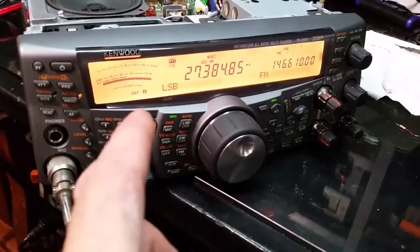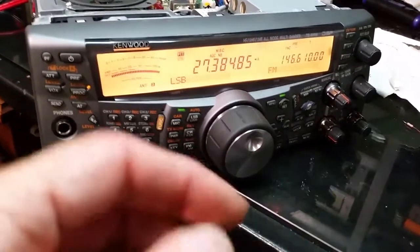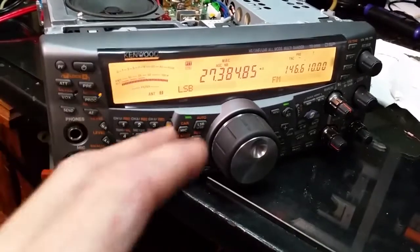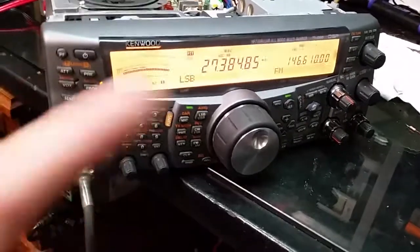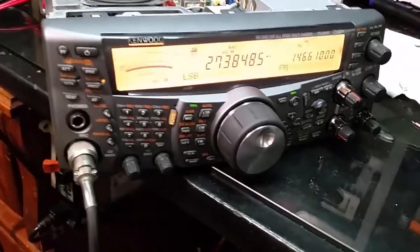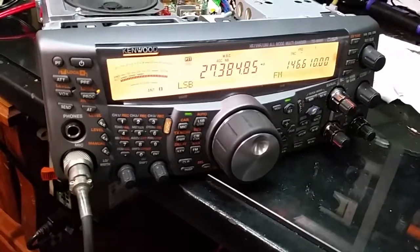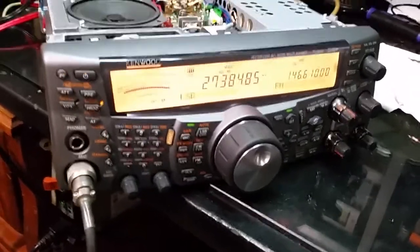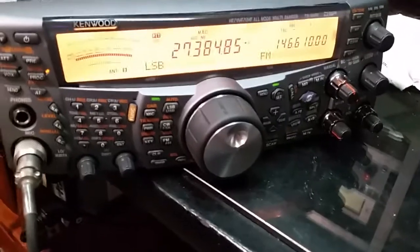The problem is everywhere as you look online — they don't come up to power on sideband. You could scream into this thing and it'd do maybe about 55 to 60 watts. It would show a PEP of 100, but it wouldn't talk up to a hundred. A PEP meter, if somebody doesn't know any better, would show peaks of 100 — but it's not. Don't go by PEP, go by your average.